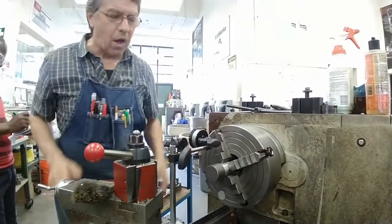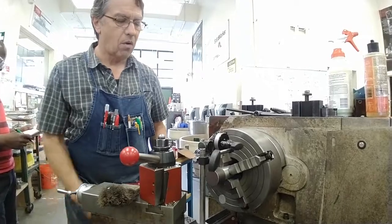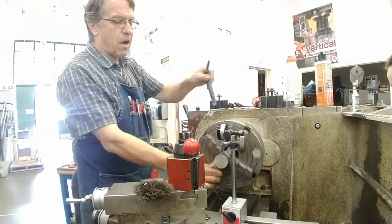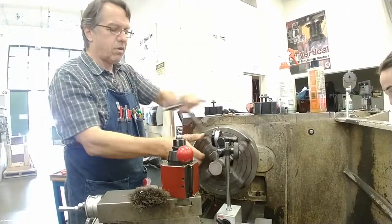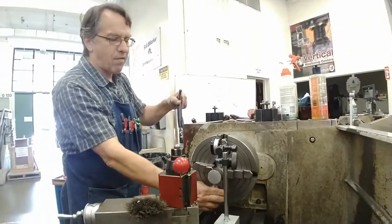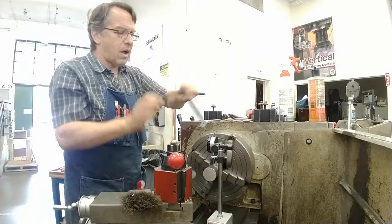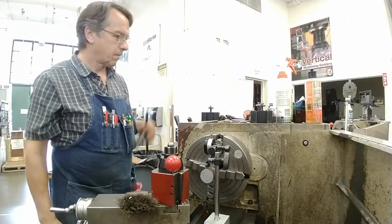Most of the time when people don't want to true something up, it's because they don't like truing up because they're having a hard time with it. So if you find that's true, get help because we can make it easy. Okay, find the low side, loosen it, find the high side, tighten it. You'll learn how much to loosen and how much to tighten. When it's within about 5 or 10 thousandths, just tighten the high sides. And then go all around and tighten all 4 jaws and make your final corrections. What, 2 minutes? Okay.